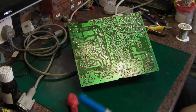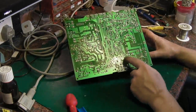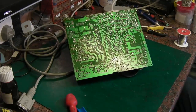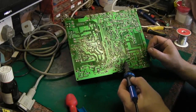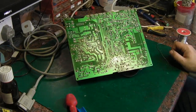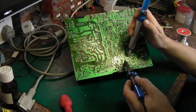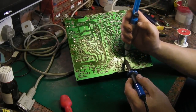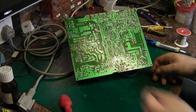Let's have a look at the first capacitor we're going to take out, which is the 220uF — those two connections there. We'll wet it up with a bit of fresh solder. I can still smell that electrolyte even though I've really cleaned the boards down very well. Once we've got this component out we might even have another quick clean up.